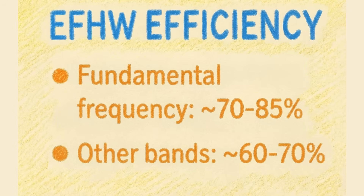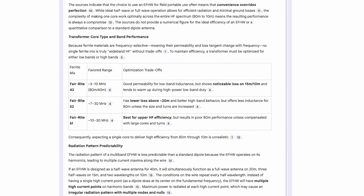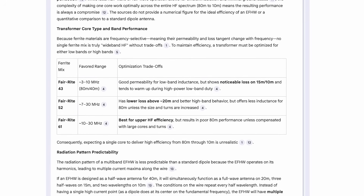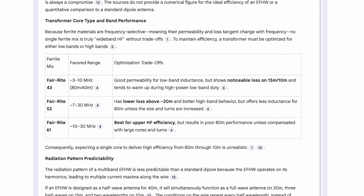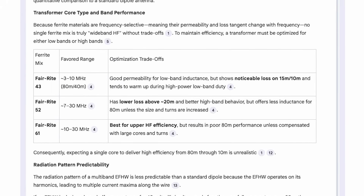So that's pretty darn good. And you can still use it on other bands without a tuner and without switching antennas, which is really convenient — but it is less efficient on those other bands. Another big point about the end-fed half-wave is the quality of the transformer, and specifically how it's built. There's a lot that goes into building a transformer, including how you wind it and what the core is made out of. The core material makes it better for different bands — the same core probably won't work well across all bands from 160 meters up to 10 meters. The core you'd want for the lower bands like 40, 80, and 160 meters would be different from one suited for 40 to 20 meters, and once you get up to 15 and especially 10 meters, you might want a different core again.